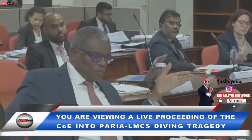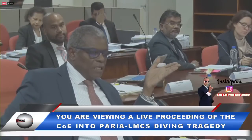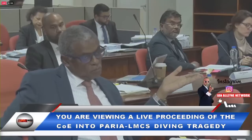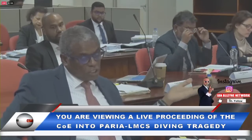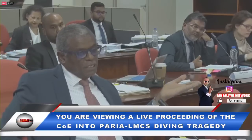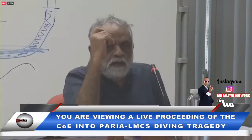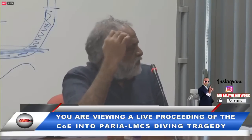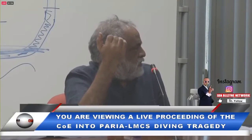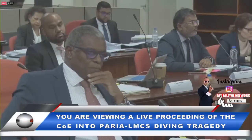Another conclusion or explanation, well, we all know it's into the realm of speculation: if the plug was at its best, the delta P force may not have been able to pull it in. If it was at its best, completely pressured up, properly installed, properly braced.